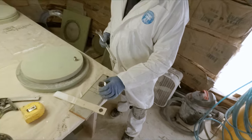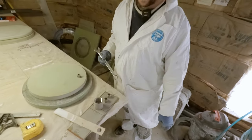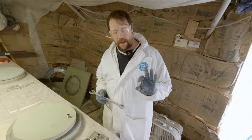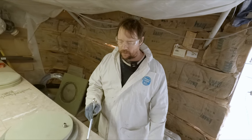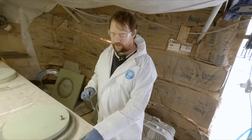And we're not quite sure where the positioning on this is. We're gonna jump down here and we'll run a bit through the wall and then probably about an inch off the floor right here. And then we can see where it falls on the other side, and that's gonna help us align this. The drain we want as low to the floor as possible.